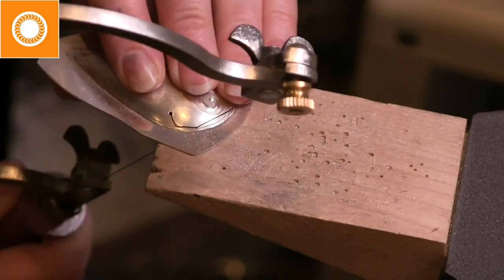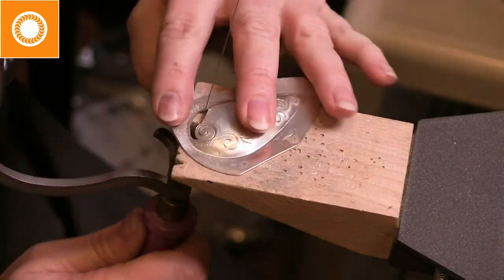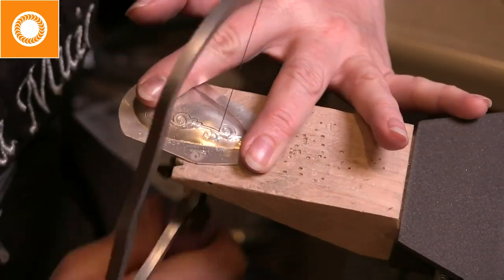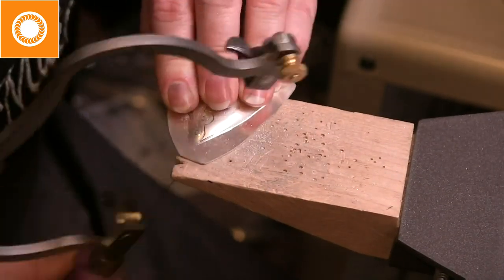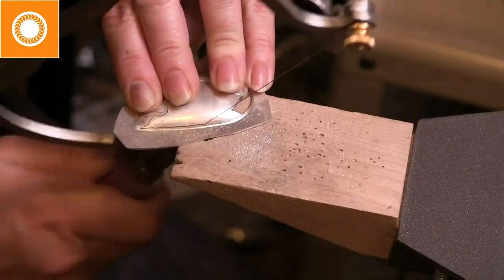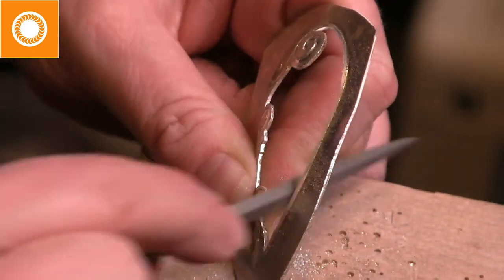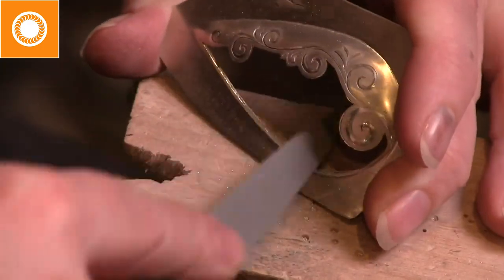Now I'm going to cut out the inside. Notice my saw is not straight up and down - we're always told to keep our jeweler's saw straight up and down, but what I'm trying to do is keep my saw cut perpendicular not just to the piece but to the shape of the piece. Because my piece is shaped, I need to angle it accordingly. I wasn't perfect on that, so I have cleanup to do. I'll bring in some needle files - this is sped up about 800 percent.